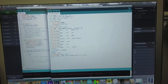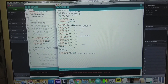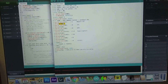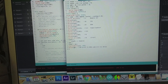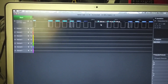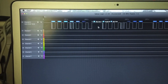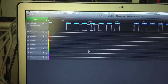I had to play with the delays because the Snap-on scanner does look for timing, not just the numbers. After every number there's a 30 millisecond delay between each byte sent, and at the very end a 70 millisecond delay for the final gap. The capture shows our end byte at 52.06 milliseconds and final gap of 12 milliseconds — compared to the TCU's 52.2 and 12.04. We are damn near right on the money. That is a near-perfect emulation of the TCU output.